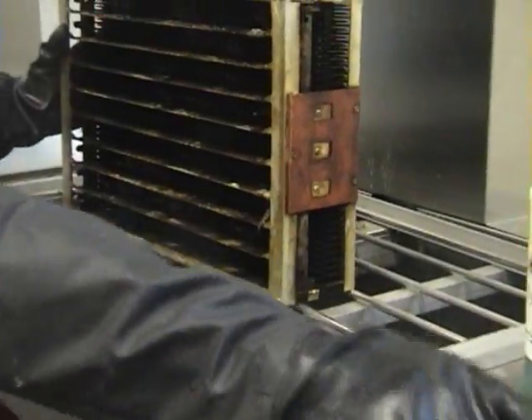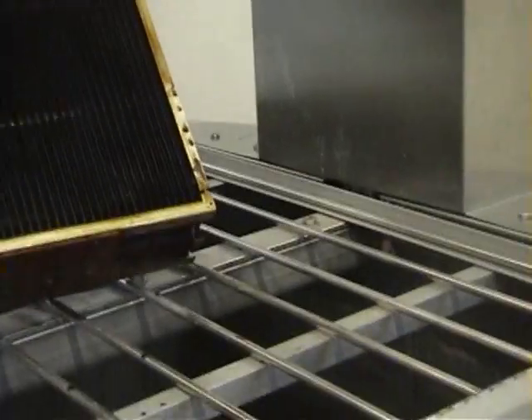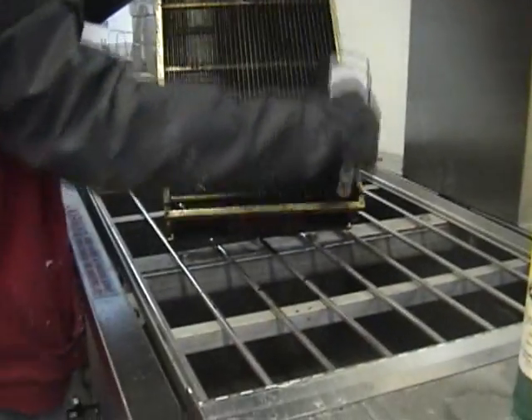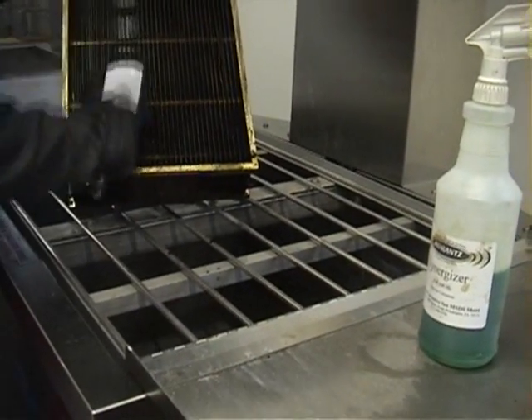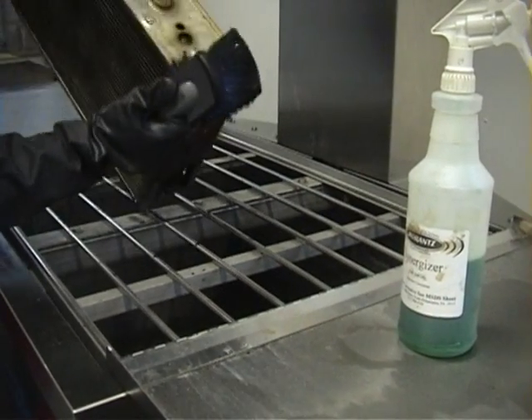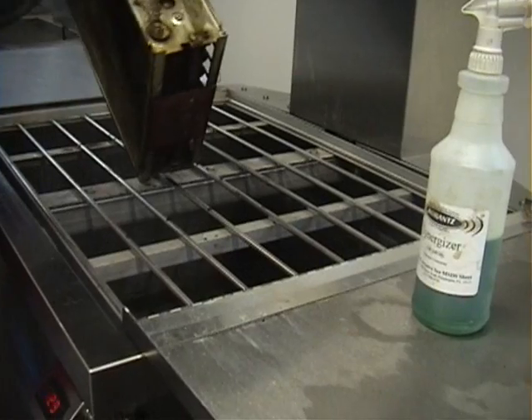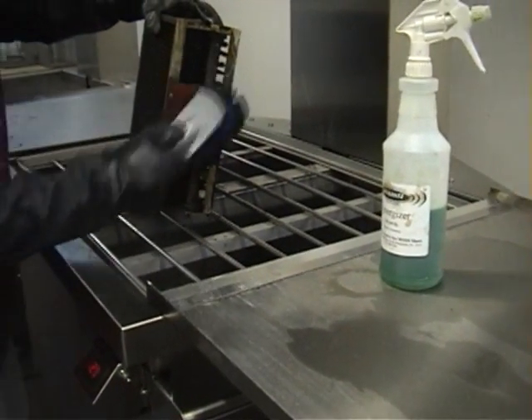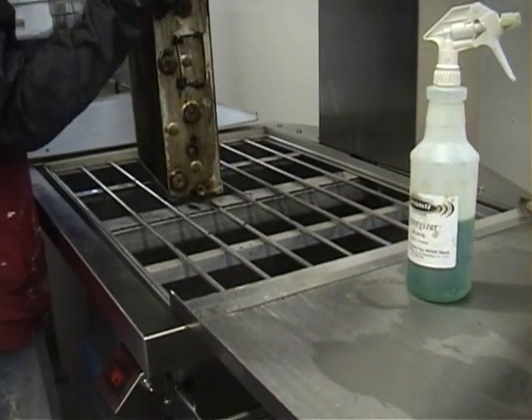Just take the brush and give it a quick brush over to work some of that in — this is a soft bristle brush, nothing hard. The other advantage of that pre-wash tank is that when you have all this initial dirt that comes off, it doesn't overwhelm the ultrasonic machine. The ultrasonic machine does work really well with extra dirt in it, but we don't want to have to change it all the time. So the pre-wash allows us to get a lot of that excess off. The pre-wash also has a filtration system on it to help keep that water as clean as possible, so really you're changing all the tanks at the same time.